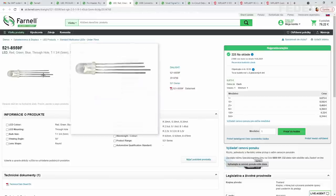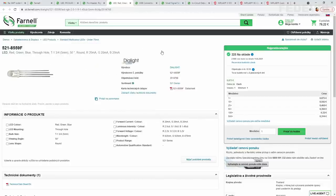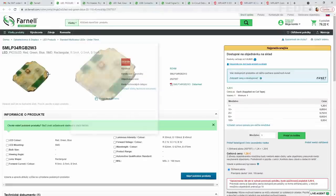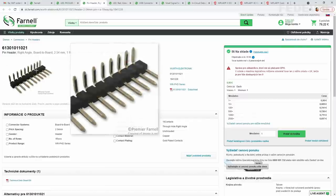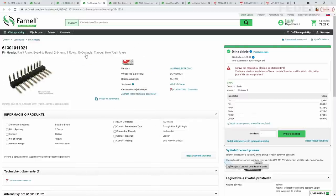We can directly solder these pins to the headers. And also, I can maybe use some of these LEDs from my previous project. I can desolder them, and solder them on these new boards which will come in. I'm also going to buy the header for programming, but I found it very useful, when buying these kinds of headers, to buy the longer one, and then I can just cut the number of pins I need. So I'm going to buy some of these.